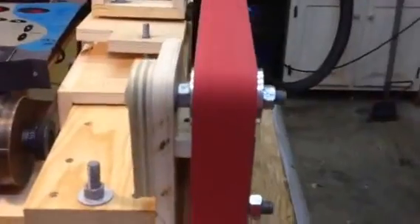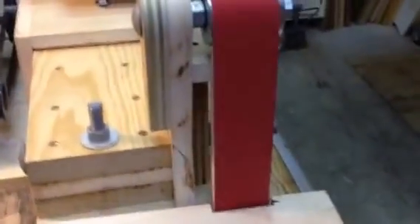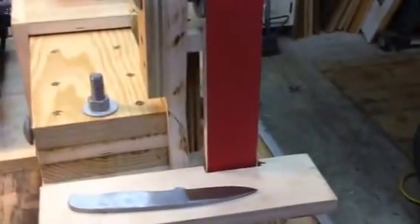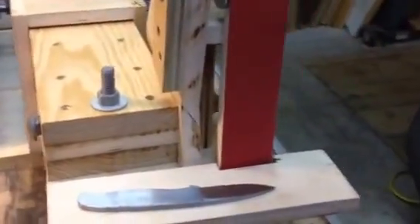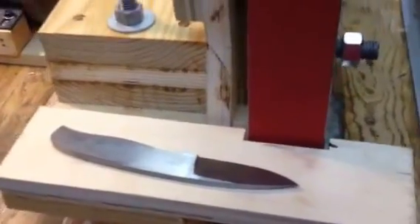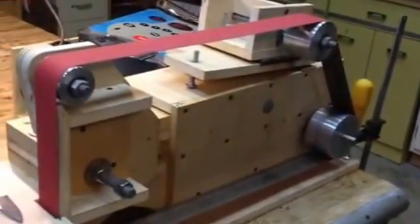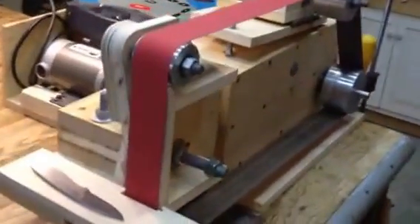The tracking is something that everything's not perfectly centered, but it's pretty good. When you're using the grinder, I have to keep messing with the tracking a little bit to keep it where I want it. I suspect that even on commercial machines that's probably something of an issue, because as the belt warms up and expands and contracts and clearances change, the tracking is going to change. But it's not a big deal. You can see there's a knife blank that I worked on just to try it out yesterday when I first got it going. There are a few details I still want to take care of — some knobs and handles and a few alignment issues — and right now it's just clamped to my bench top. It's a pretty big machine, so I don't know exactly where I'm going to put it.